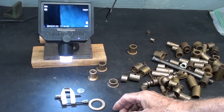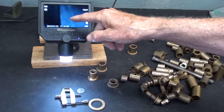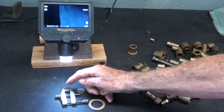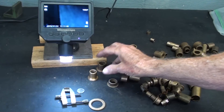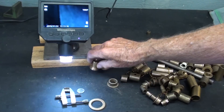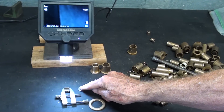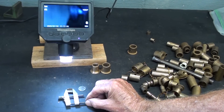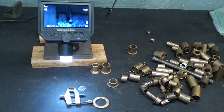What I'm going to do now is show you a few bearings with my little microscope. I've got a broken bearing here — the other half of that smashed bearing — so I can show you how porous it is. I also have a dime so you can get an idea of the size. I'm holding the bearing in a little Brown & Sharpe clamp. You are now looking at the screen of the microscope, and this is a sintered bearing underneath. Can you see how porous it is?